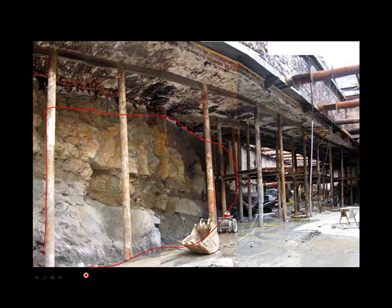On either side of the tunnel you install secant pile walls, but the secant pile wall ends as soon as you reach the existing tunnel. That leaves a long stretch for which there is no traditional means of support of excavation. You cannot put in the secant pile wall, you cannot drive piles for soldier pile and lagging. There's really no way to support this area if it happens to be earth.